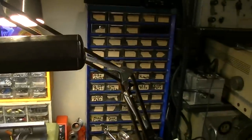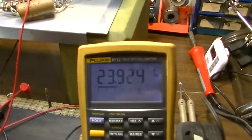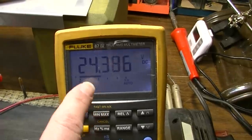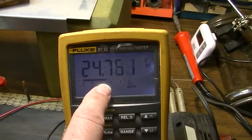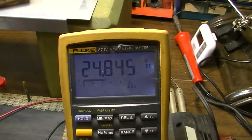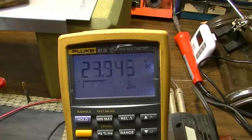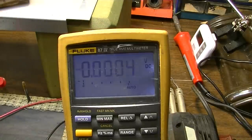And if you're in a situation where you can't hear the output on something like this, or you have a dummy load in or whatever, and you don't feel like hooking it up to a scope, you can always just meter it and see if it's jumping around. And it is. You can hear it even going with the sound there. The oscillations will get faster. Okay, so tremolo is good.